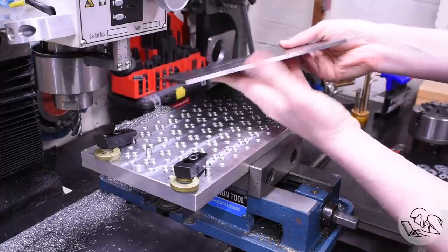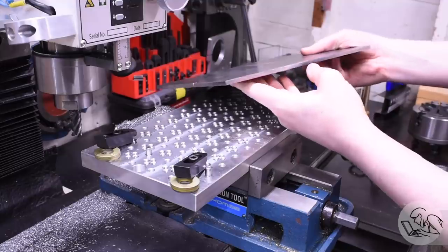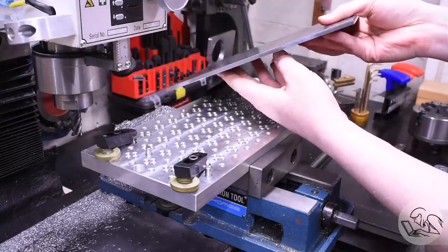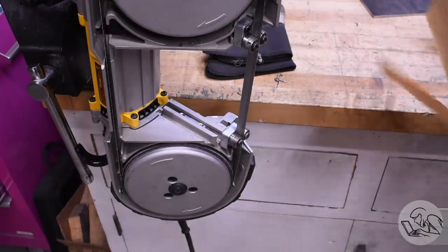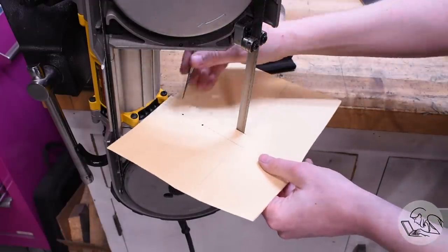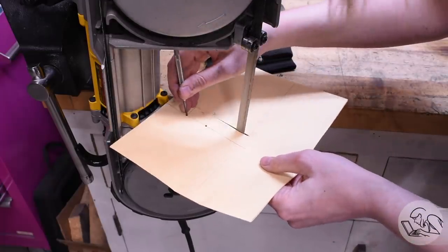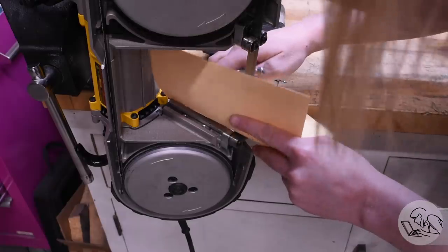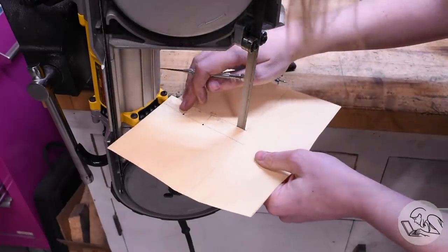The other two sides were done that way, then I deburr everything and round those corners a little bit with a file, and that's all looking good. That Niagara cutter did a beautiful job on those edges — the finish is outstanding — everything looks good except for that notch there, a little cut from some previous angle grinder project in this stock that I didn't notice, but you know, a little bit of character. Now the tricky part: figuring out where to put all the features on this plate. I made a paper template here and I'm laying things out to make sure I can put my slot and my holes where I think they should go. I certainly don't want to do this twice.